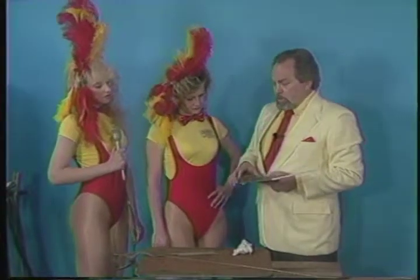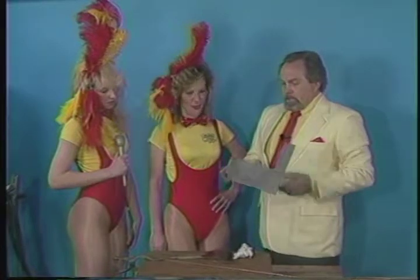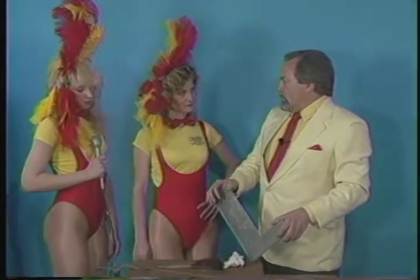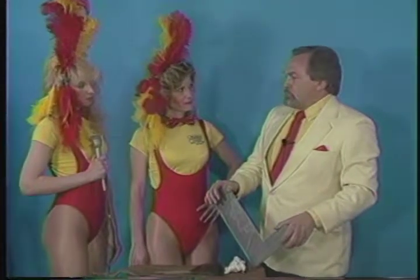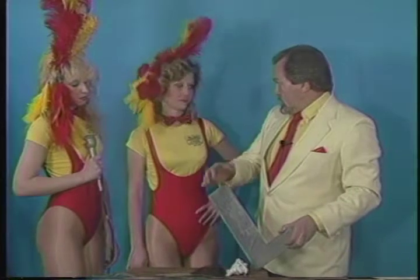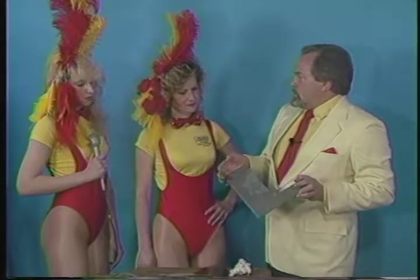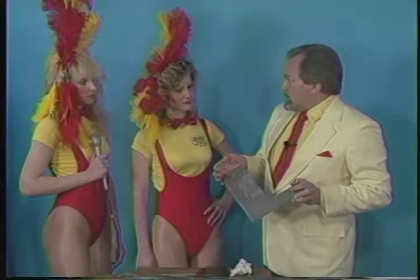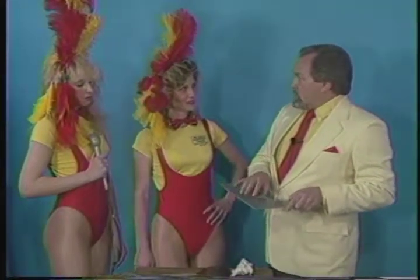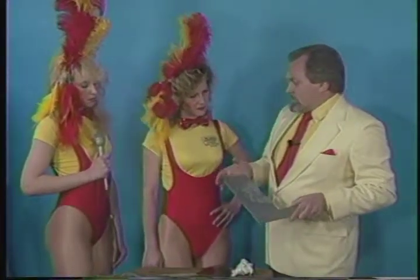The problem with welding aluminum is that there is something on aluminum called an oxide, and I'll refresh our audience's memory, we've talked about this before, that an oxide is the combining of oxygen with a material. Rust is an oxide, okay? But you can't see it on aluminum. You can kind of see it, like if you've seen storm doors that are up for a long time, they start to look darker and darker in appearance. What you're getting there is that the oxide is getting thicker and thicker, just like rust getting thicker and thicker. It's essentially transparent. You can't see it.